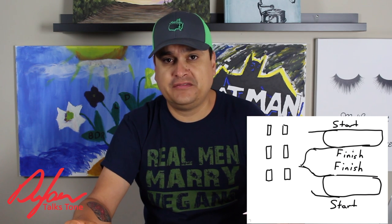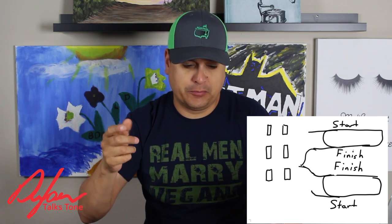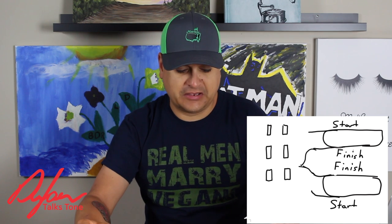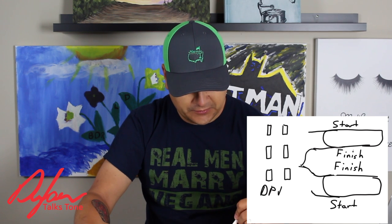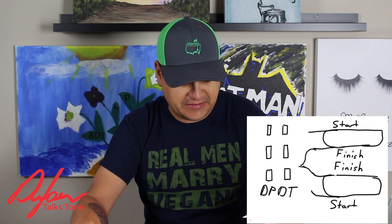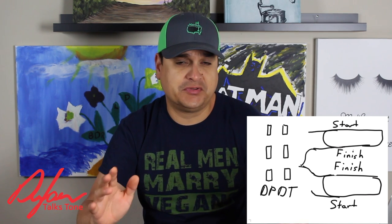You see these six squares on the left side? That represents your normal DPDT — dual pole, dual throw switch — that you see on most push-pull or push-push style switches that you're going to use to do this, as well as some little toggle switches. It's called a DPDT switch. Here's how this switch works: it looks kind of confusing but it's actually two switches. The left side and the right side do exactly the same thing, so in other applications you can do multiple things at once.